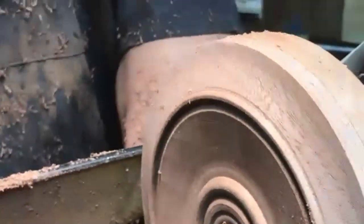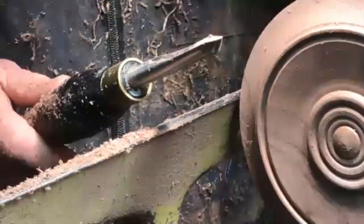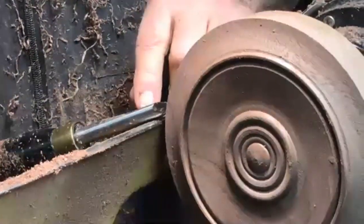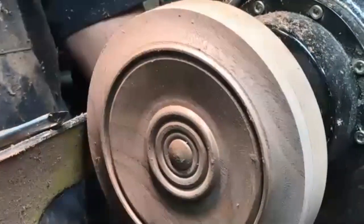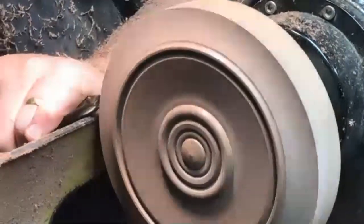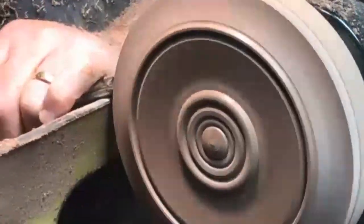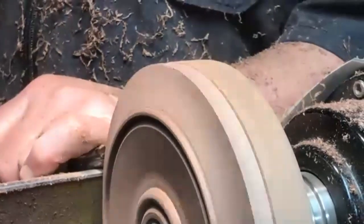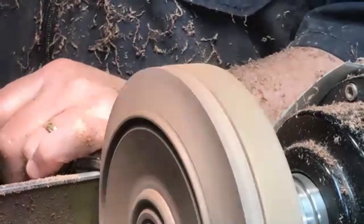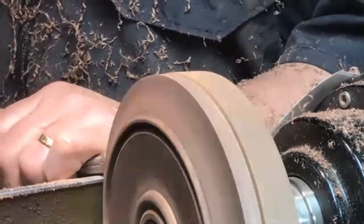I'll turn this one around. I want to get it somewhere a little bit below center. With the pointed tool, I'm going to bring that bead around. I'll just take a look at this and see how it looks - you change your designs as you go. Right where the two pieces are intersected together, I'm rolling into that seam. I start with the handle very low, roll the beads down into that section, and can take a little wood off the other one.